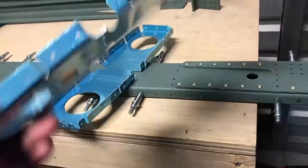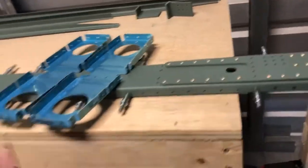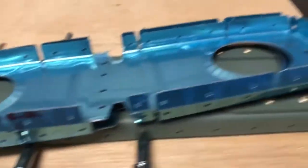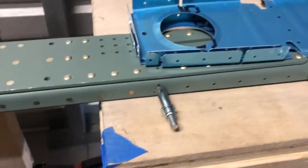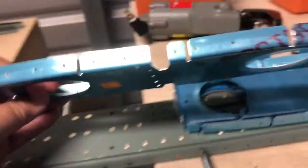I went ahead and pulled the parts from the other shop. I had to trim some pieces off, so I trimmed those using just hand snips — nothing crazy, just a little snips. Then I've got to deburr them. I need two that have just this one piece trimmed off, and two that have both pieces trimmed off. These parts require some modifications — we've got to do some bending, some fluting, which is new.